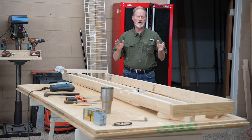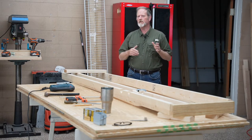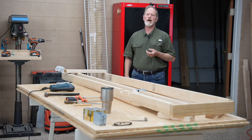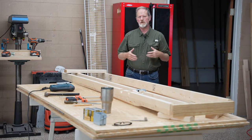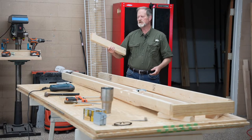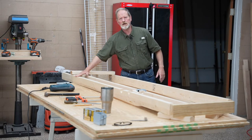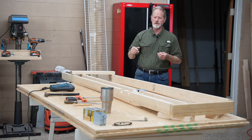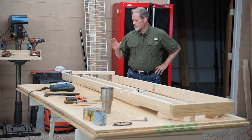We're going to put up the wall in a number of sections. The first section we're going to put up is right next to the garage door, because I've got a lot of electrical going on there. I want my relay, my remote control switch, the switch to the outside light, and one external outlet all to be available at that point. Then I want my cyclone located next to that, with the ability to put a closet wall around it to dampen the sound. I've already measured it out. I've got two studs with a stud spacer in between — that's going to cup a piece of conduit line that comes down from the ceiling. I'll leave this stud open from the plywood so the next piece of plywood can attach to it.